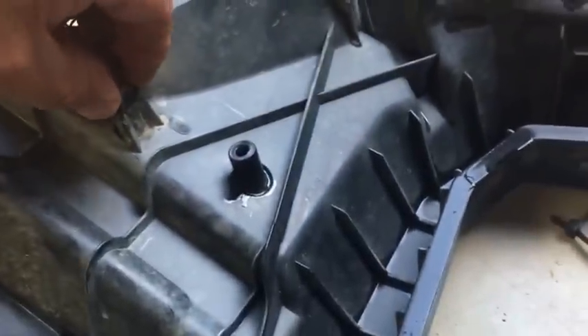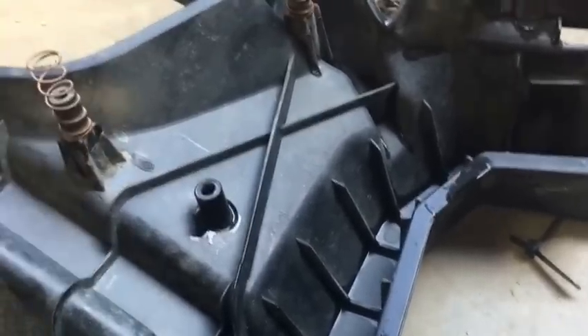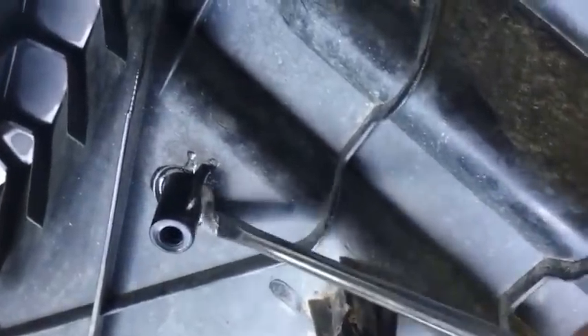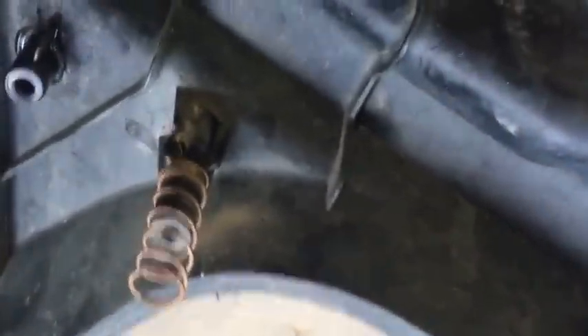The next step is really adding the powder substance. I'm taking some powder on a screwdriver and just pouring it down in here. Then you take the glue and put some drops on it - you'll see it absorbs right in. I put the gray on there, it just absorbs right in. You can see it turns wet, and literally you just have to wait a second or so and it bonds right away.